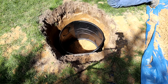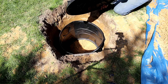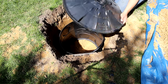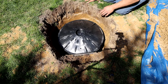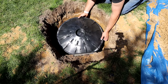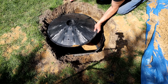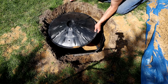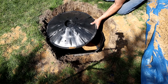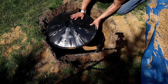You can see that thing's a lot deeper than it needs to be now, but we're going to add gravel. And we can't forget about the lid — the lid adds about 5-6 inches to the overall depth of this thing because you can see it's tapered. So when this thing snaps into place, we're even closer to ground level. You really never want this thing to be up too close to ground level, because if you're going to be planting grass back over the top of this, the grass needs a place to grow — the roots got to be able to get down into the soil.